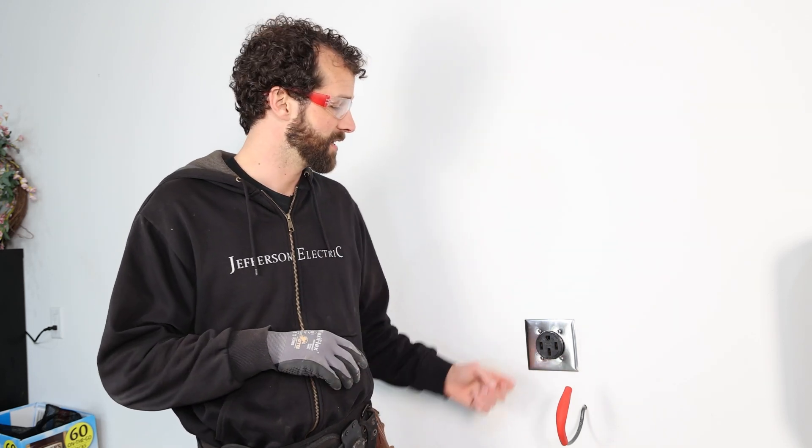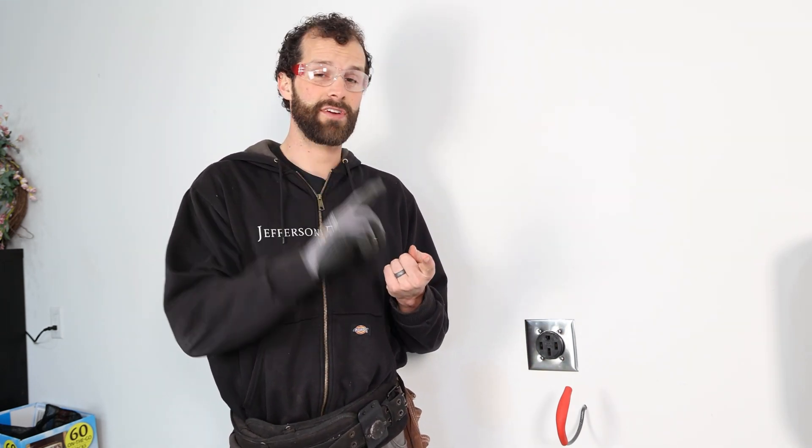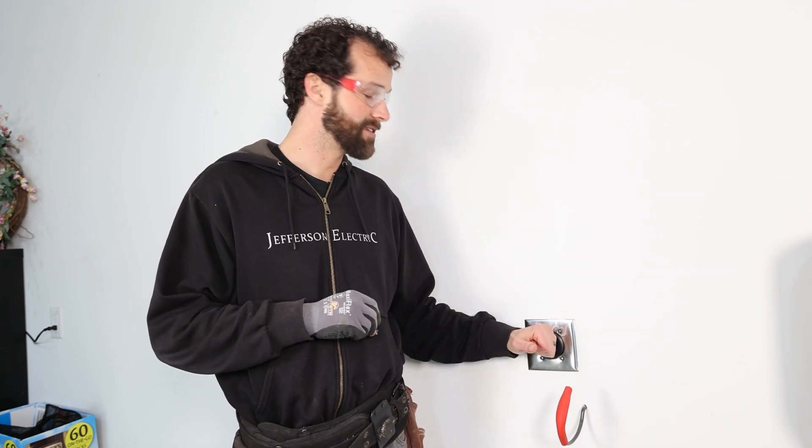That cheaper plug has been responsible for house fires in America. House fires are responsible for hundreds of millions of dollars of property damage every year in the US. The HBL 9450A is the EV go-to, because it's going to handle a massive amp draw for a long period of time — 3, 6, 8, even 10 hours for large-capacity electric vehicles. It's specifically called out in certification processes like Tesla and other well-known EV manufacturers as the go-to.